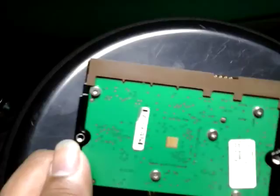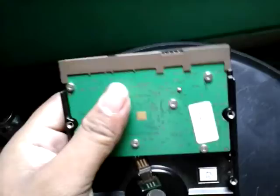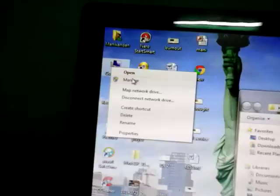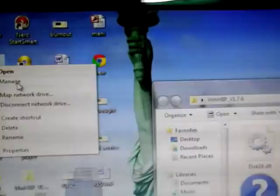When a diode gets burned on a PCB board you can easily swap it from another board. You need some soldering skills to get it working again. There's some valuable data inside this hard drive so you don't need to spend a lot of money. I'll show you — let's power it up. I'm using this hard drive on a PS2 console. If you're using it as a PC hard drive, you can check if it's working by going to My Computer, then Manage, then Disk Management.